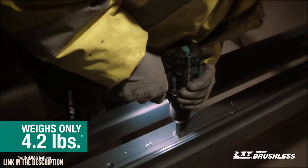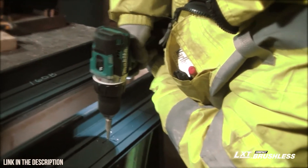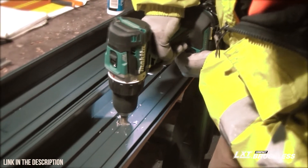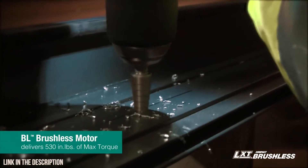These are window headers and we put them up — they have to be pre-drilled so that when the guys go up to put them up, they can just put the bolts in and go. On a daily basis we have to mark exactly where the holes are going to be drilled, and I put my half-inch unibit on, then I get my slick stick and grease up my half-inch unibit, and proceed to drill about a thousand holes a day.